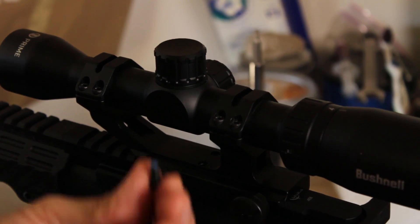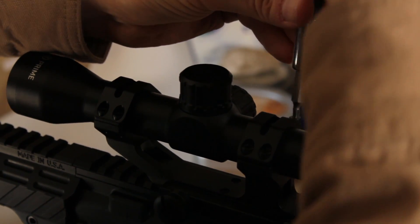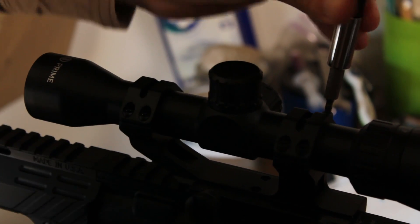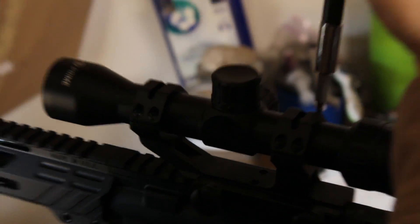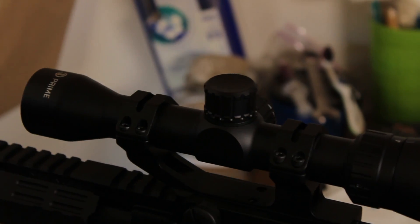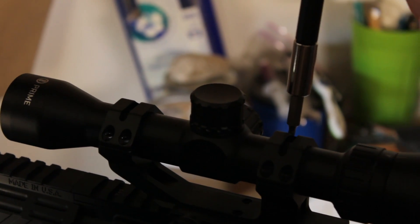To make sure we're evening all the screws, I'll show you what we're doing here. Getting it placed, and then I'm actually backing it out until I hear the click, knowing that the threads have just engaged. And then we're counting six full turns on each of them to start — one, two, three, four, five, six. Then going in the same pattern on each pass, we're going to do half turns until I start feeling resistance.